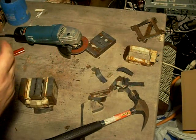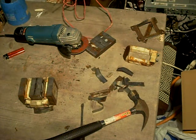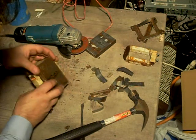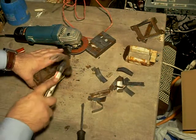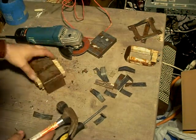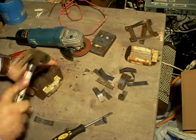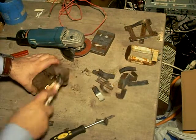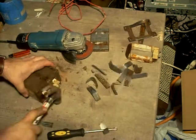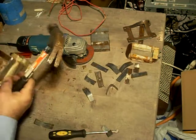The high temperature wire is quite handy in itself to keep — it's fairly high current, probably several amps. And then you've got the high tension winding here, which is rated at about two thousand volts. I was originally going to try to keep this wire, but the state of this transformer — this is basically copper scrap. As I said, I have several others. Let's see if I can show you how the winding is made. It should be loose enough that I can knock it while holding the core.